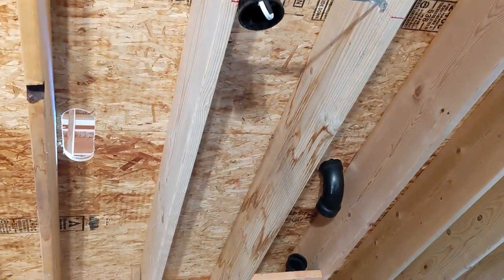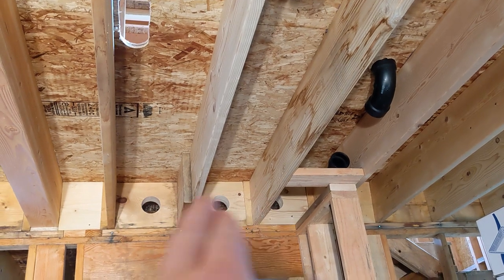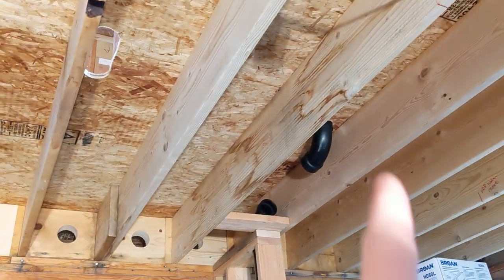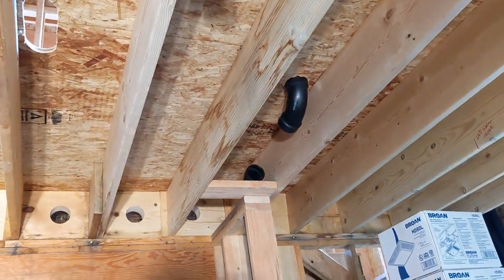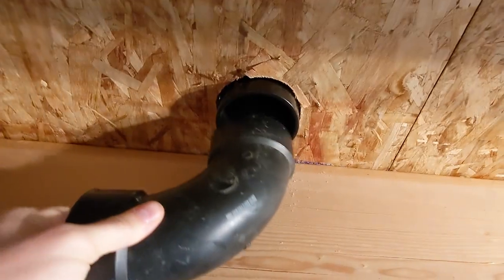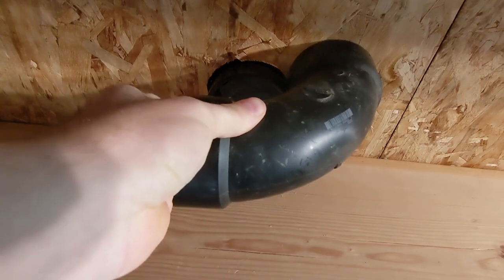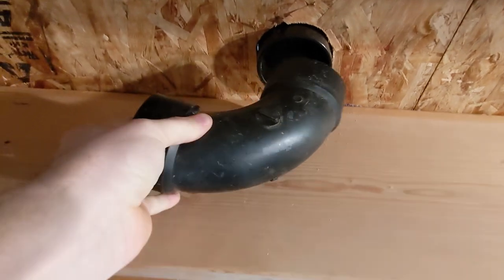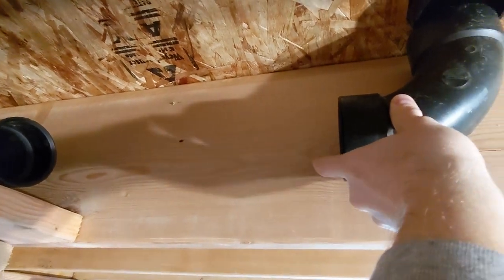The one that has to go first, in my opinion, is actually the plumbing. These have some flexibility to them — after they're past this hole it's flex duct. That has no flexibility to it. You have to meet slope, and you have to be able to make it all fit together. It's going to come down a little bit further, so this is just going to allow us to run almost straight over. It's still got a little bit of a downward slope, which is perfect.